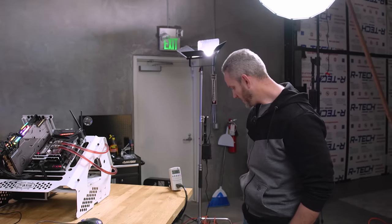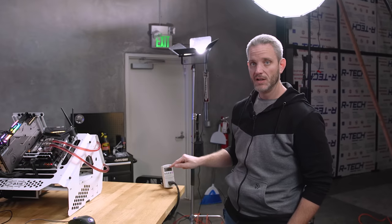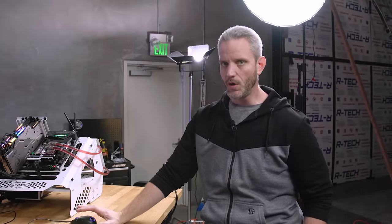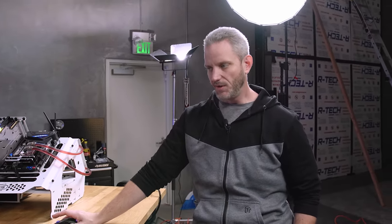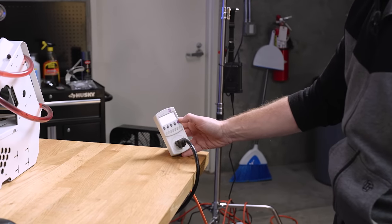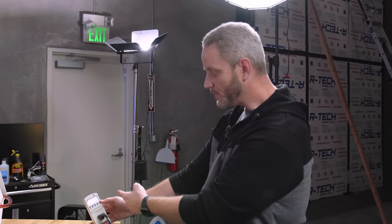When I hooked up the first extension cord I saw 117 volts — that may not seem like a lot, but as you drop to 116 or 115, that starts to have a big discrepancy in terms of the cleanliness of the power because of the resistance added by the extension cord. We're using 16 gauge wire; if we used 14 or 12 gauge — remember, the lower the number, the thicker the wire, the less the resistance. The 100-foot cable is plugged in at 118.6 volts idle, and when I turn the system on it drops: 117.5, 117.3, 117.1.